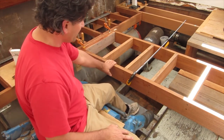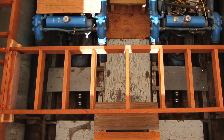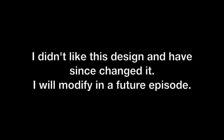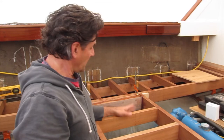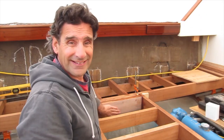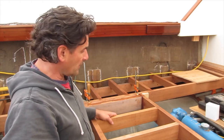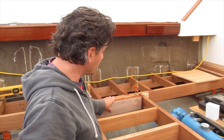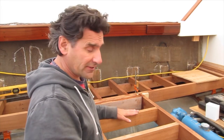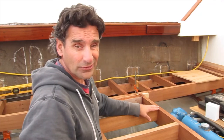That's it — this side's done. Now I'll do the other side. What I'd like to accomplish today is finishing up this whole center section piece. One of the things I want to do is install the bolts — three bolts that are going to actually connect it to the side frames — so I have to do that on both sides and drill these. To do that, I'm going to have to take out this piece because I can't get my drill in here. Once I get those drilled, I'll clamp it back in place and permanently attach all of these intermediate pieces.